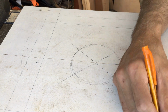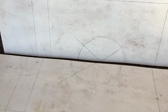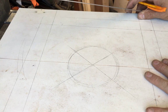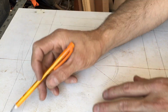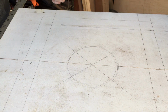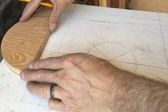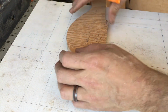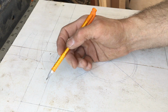And this material is 5/8, so it's really strong. So even though I'm going to cut out this large pocket, it's still going to be strong. And then when I insert this, I'll put some silicone around here and blob down this and then screw it down. And then I will use some scrap, whatever, and on the underside I'll just put some ties just across this, or probably this way. Actually, I'll take it up to there, so I don't get confused, because there's a lot of lines on here now.